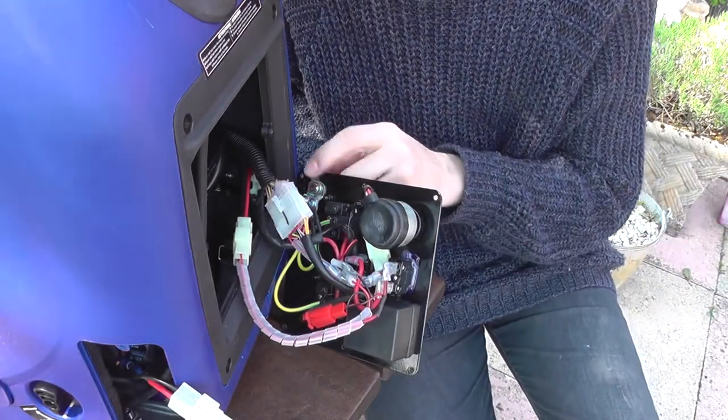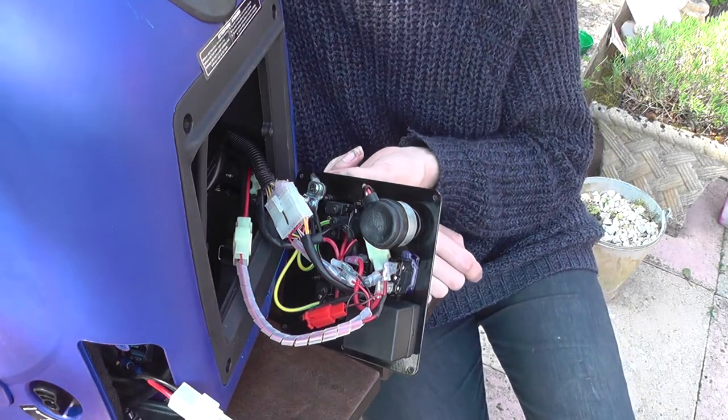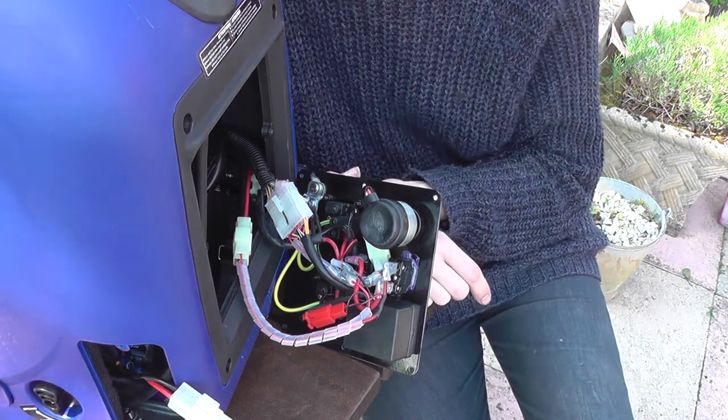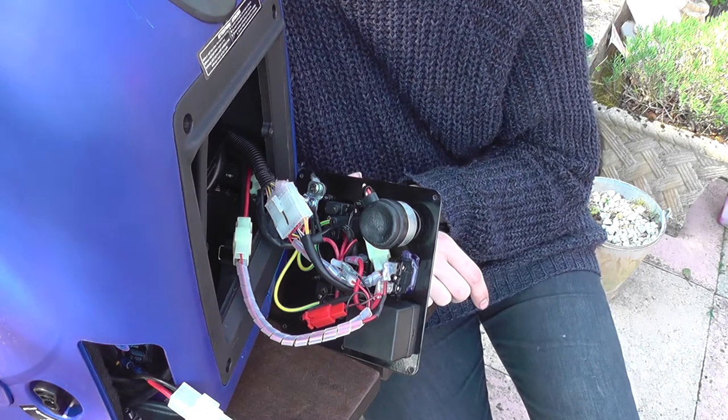Earthing pin here, that needs to go to ground or grounding spike, but on my boat it will go to the steel hull, probably through the galvanic isolator, although that's really just for shore power. As it's on the boat, I'll just put it to the same thing anyway.